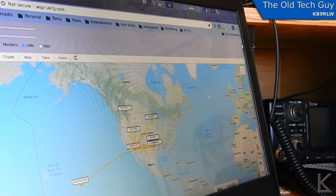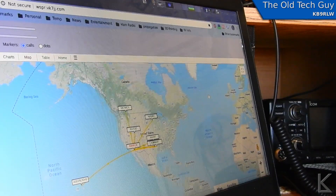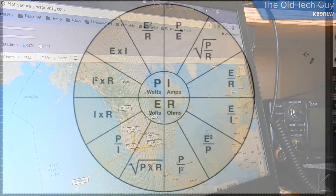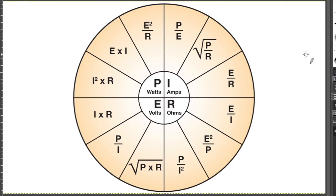So what's going on? How much power is the radio actually putting out? Let's find out. I'll get the oscilloscope and the dummy load out, do some measurements and a little calculation, and we'll see how much power is leaking out when your ICOM 705 is set to zero. I don't have lab equipment capable of measuring power in the milliwatt range accurately, but I can get pretty close using my oscilloscope, a dummy load, my VNA, and Ohm's law.